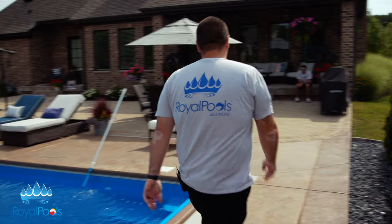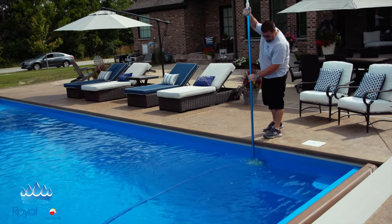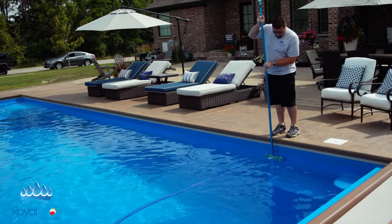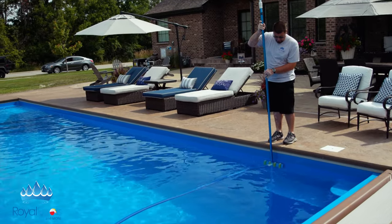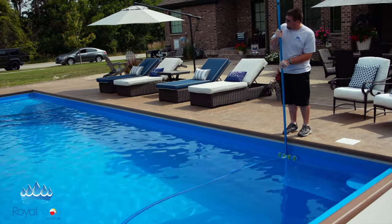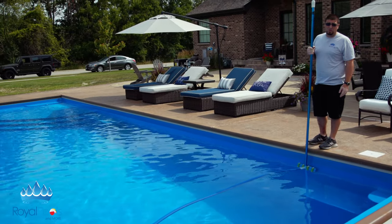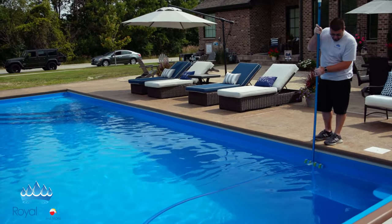We're going to walk back over here. The little trick that I like to do: that hose wasn't full of water and the pump could lose prime. So I like to take my vacuum head, put it right over the return, shooting water from the return inside the hose, helping to eliminate the air quicker. Eventually the pump will lose a little bit of prime — it might not even do that actually — but we're introducing air into the system. I can actually hear it coming back down right now. So you want to take about 30 seconds here, making sure we keep pushing that air back in. The pump just dropped — I can tell because the return pressure lowered — that's all right, just sit here for a minute. You can hear the pump in the background revving up to reprime, and what it's doing is trying to draw more water because we introduced a bunch of air. You can actually do this before you put it in there too, and it helps either way. Most people fall into problems when it starts to prime again — that's why I wanted to show you this. Either way will work, just whatever's more convenient for you at the time.